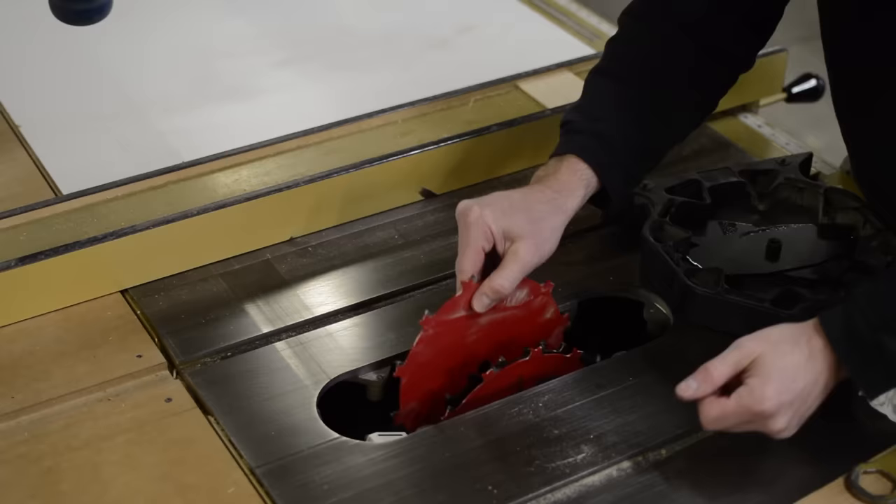Here's one of my very favorite pro tips: overcut the shoulders of a tenon just a tiny bit — a 32nd of an inch is plenty. This creates a channel for glue to fall into as the two parts come together and greatly reduces the chances of squeeze out. Since I cut the lower mortises with the router, the four corners are radiused — I decided to round over the tenons versus square up the mortise. I think it was at this point in the project I made a mistake. I normally like to square up the mortises as I think it gives a more hand-cut appearance. But I was in a hurry, so I rounded over the tenons to save time. In the end I think the joint looks more machine cut and not quite as refined.